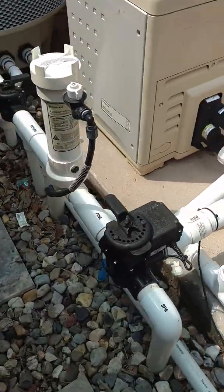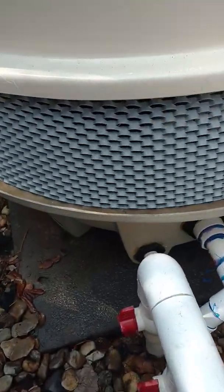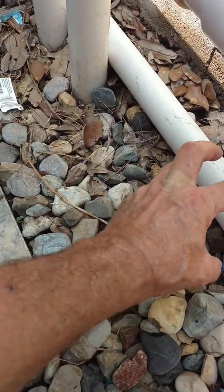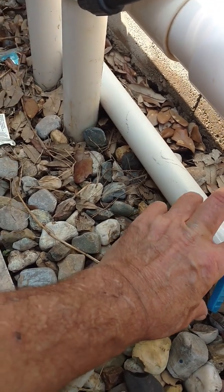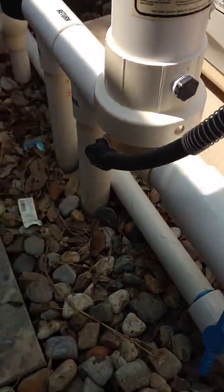Now this valve down here with the blue handle is the balancing valve and you should not have to mess with that — in fact it's better not to. But we do have to verify that the propeller is turning at the correct speed. If it goes too fast, water will pour out of the overflow, and if it starts going too fast, this would have to be turned clockwise — just an eighth of a turn or so. It's very delicate. If it's going too slow or not turning at all, you crank it counter-clockwise, just an eighth of a turn or so, and check it until you get it balanced right. But as long as the pump's running the same speed, you should never have to change that.